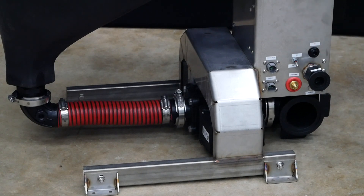This is our main power switch. It is normally turned on for the duration of when you're mixing — turned on and stays on all day. Typically systems are left on all day, but if you're not going to be using this system for an extended period of time, turn this master power switch off. It will completely cut off all power consumption to the system.